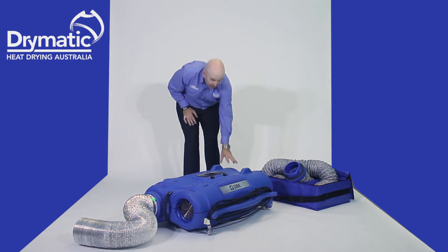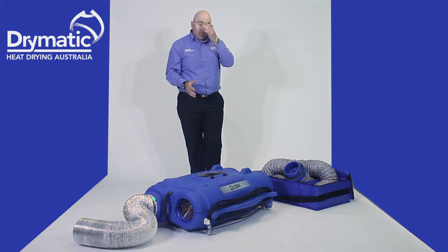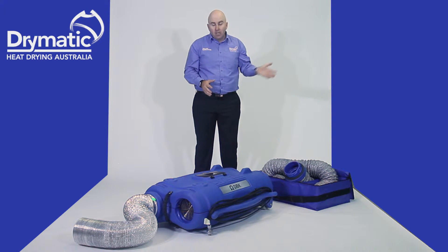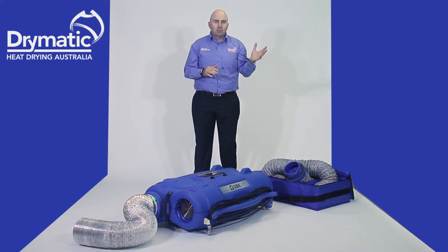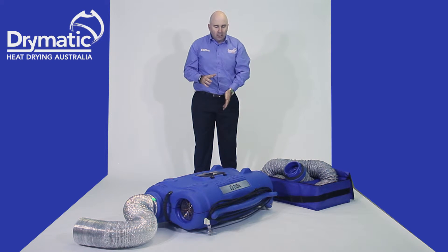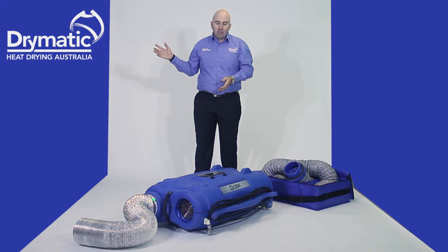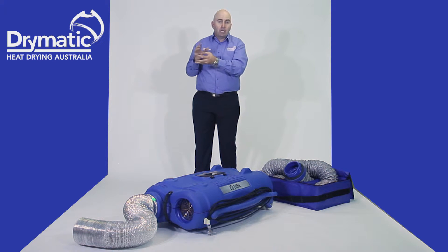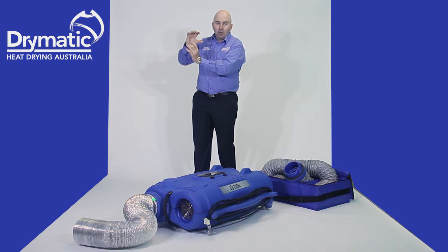The fourth port is called the outside intake. That can be outside the drying chamber — in an unaffected area, in a room where you're drying carpet and underlay with dehumidification and air movers, or sucking air from outside. If you have both the outside intake and the exhaust going outside, make sure those two are separated. You don't want them right next to each other on a window because it'll be pumping wet air out and sucking wet air back in.